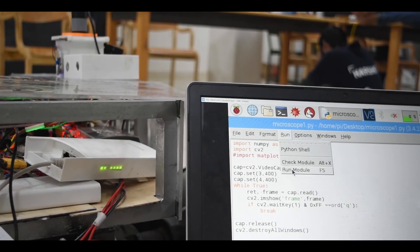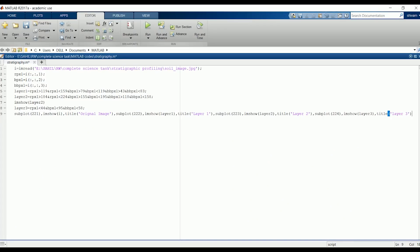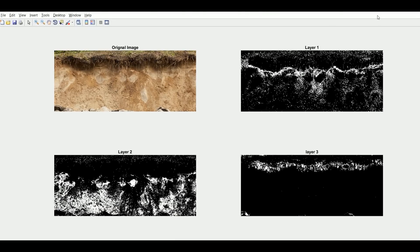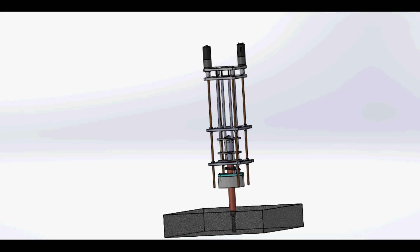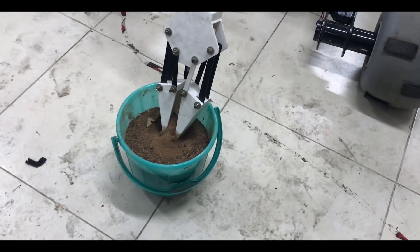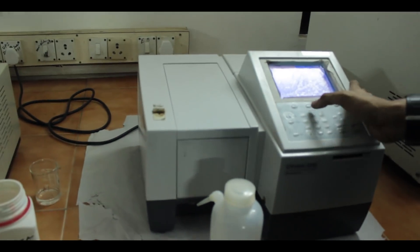For the science caches task, to determine the habitability of the site, our strategy is divided into site selection, documentation, sensor data acquisition, sample caching and laboratory analysis. For accurate soil investigation, we are using a digital microscope which is mounted over the soil box. For sample site selection, images from the panoramic camera and soil and cliff images are examined using image processing algorithms. Our drill operates on Archimedes' screw principle, which displaces soil from the ground to be stored in an air-tight cache. The robotic arm can be moved to pre-set locations on the rover such as the soil box and tool storage box using forward kinematics. Image samples are calibrated using spectroscopic data.